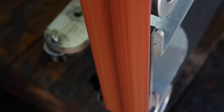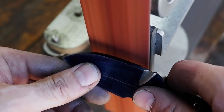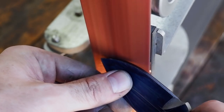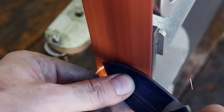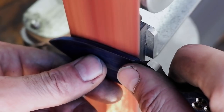With the plunge lines now established, I use a 36 grit rough belt to remove as much metal as I can, then proceed to the hand file jig to finish the bevels. Hand filing gives me more accurate results, which is why I prefer to finish on the hand files. Draw file the bevels to ensure that you finish up with a flat, clean and smooth surface.